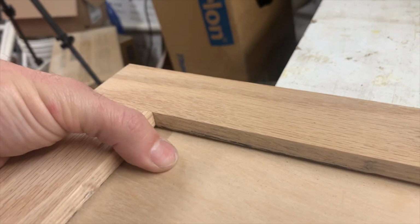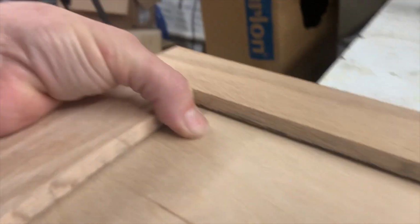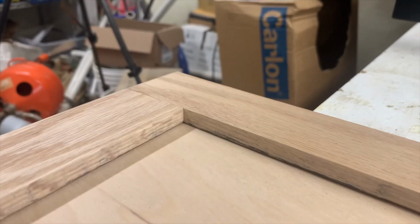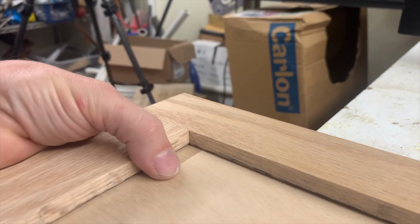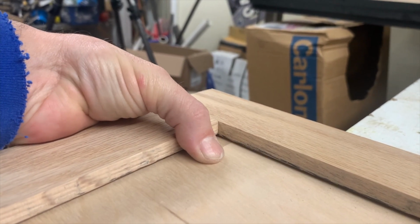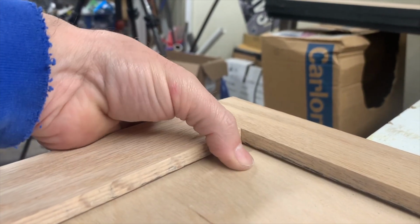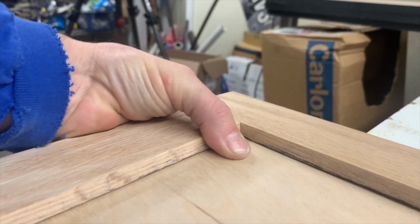This you don't have to do. And there's different ways to fix this problem, but the quarter inch plywood here is not exactly a quarter inch. So you can always cut a panel out of like solid material and make it fit that groove exactly. But I don't want that gap right there. And I especially don't want to paint it with the gap closed like this, and then eventually that paint's gonna crack right there in that seam. And I also don't want it rattling around either.